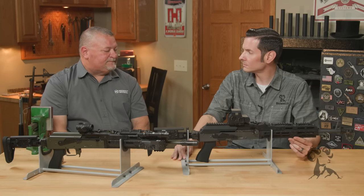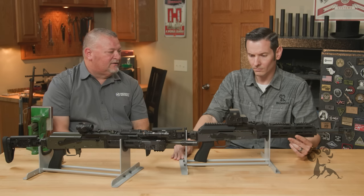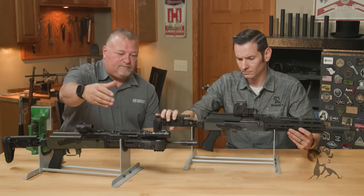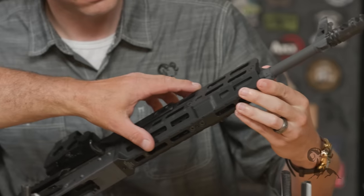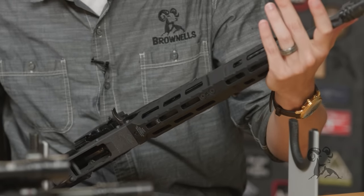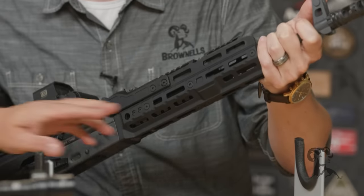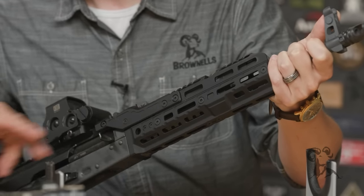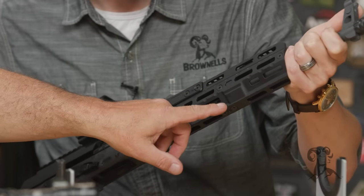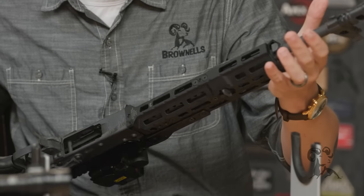Okay, wow. So these are what we came up with for handguards, and then we also dove into a stock. Basically, the Alpha handguards are either a 10-inch version or a 6-inch version, which comes to here. They're M-lock. We have a built-in heat shield in them. One of the big challenges with AKs, and you'll see it on some of the imported ones, is around the collar here. A lot of handguards will just have a little bolt-on bridge to keep rigidity in the front. That really is kind of a Band-Aid, in my opinion. We actually machined out and modeled out that area with the machining center to keep that strength in there.